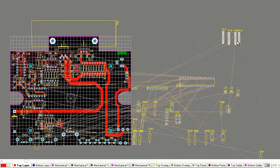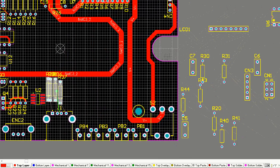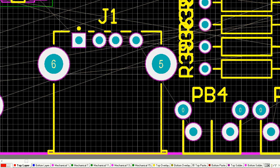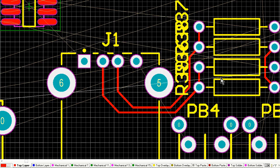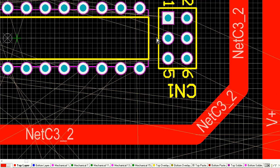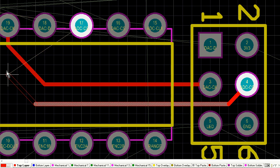There we go. I've decided to route out that whole area because now I want to drag in, I believe, my microcontroller. Or that's what I thought about there by moving that power trace. I thought my microcontroller would fit in the center of the board there, but now I'm wiring in the USB connector just to get that over and done with because there's 4 resistors that are associated with that. So I put them near the connector down the bottom.